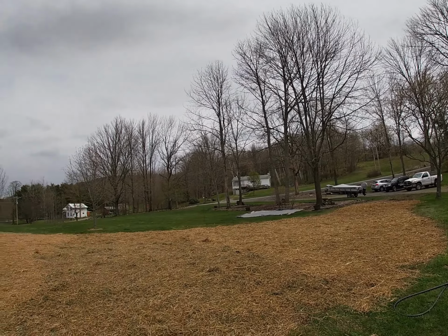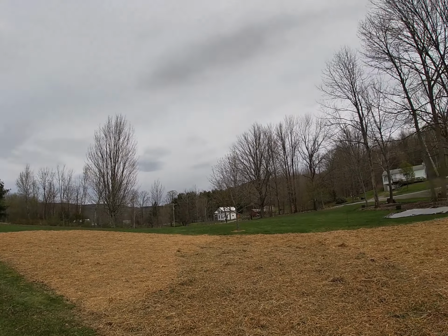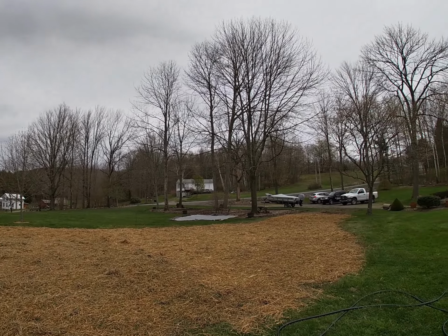And don't forget, you see how I got this straw watered today? Now, I can't show you that wind. Maybe you can see the flag. Yeah, take my word for it. The wind is really blowing, and that straw is not moving because I got it watered down. And I watered it in sections. Had I waited and tried to do all that at once, by the time I was done down there, that wind was really blowing. That was tough down there to keep that straw down. So I would have been in bad shape had I not known to work it in sections.